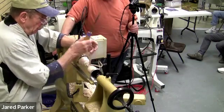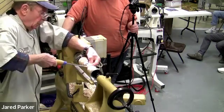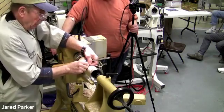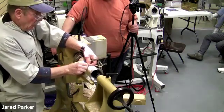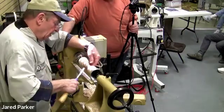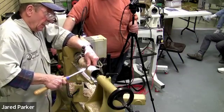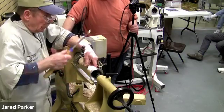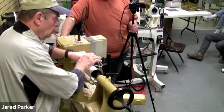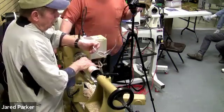I can make this considerably smaller than this 1/4 inch right here. I can make it probably down to 1/8 of an inch by just, when you get onto this thing right here and you're holding it, if you twist it just a little bit, you can clean the sides up. If you get a burn mark or a little burr on there, just turn it just a little bit. It sure beats sanding. It's quite tedious, but just hold it up there and be patient, do it a little bit at a time, because if you tweak that rascal too much, ding, it'll go flying up over your head. Especially with the softer wood, this is hard maple. So, you can get pretty aggressive with this stuff.